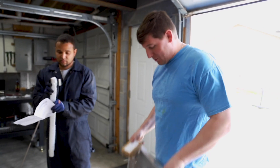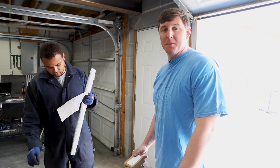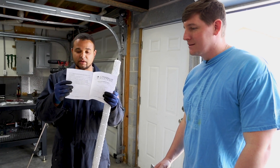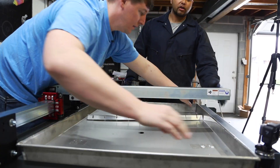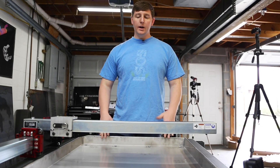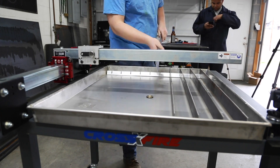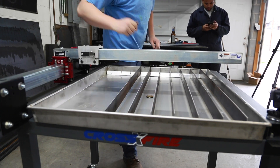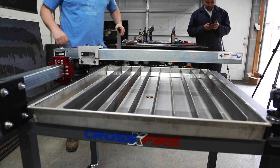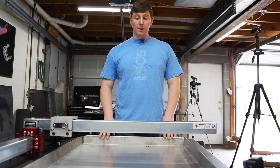We screwed up. We bought a water table with the Crossfire and it's supposed to get installed before we do the slats. It says: if slat holders and brackets are installed on the Crossfire, remove these items before proceeding with the water table installation. Installing the water table is pretty easy, even though there's not an instructional YouTube video for this one. You just lay the table on top of the crossbars. There are some self-tapping screws that go in — thankfully they already have rubber washers on them so you don't have any leakage. The plug is a very simple install right in the middle. All in all, it's actually a simpler install than the factory crossbars that come with it.